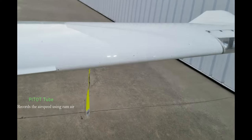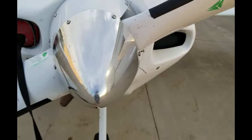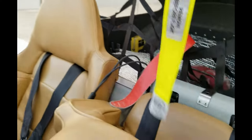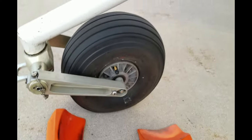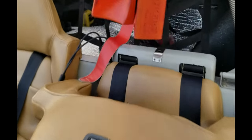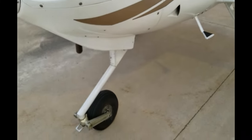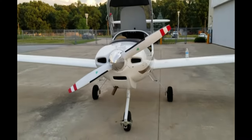The first thing I do is remove the pitot cover, then remove the engine covers and put them back. Then remove the chocks — these also go back, you don't need them until the end of the flight. The first thing you check is the air pressure — check to see if the tires have good air pressure, and do an overall visual look at the aircraft.